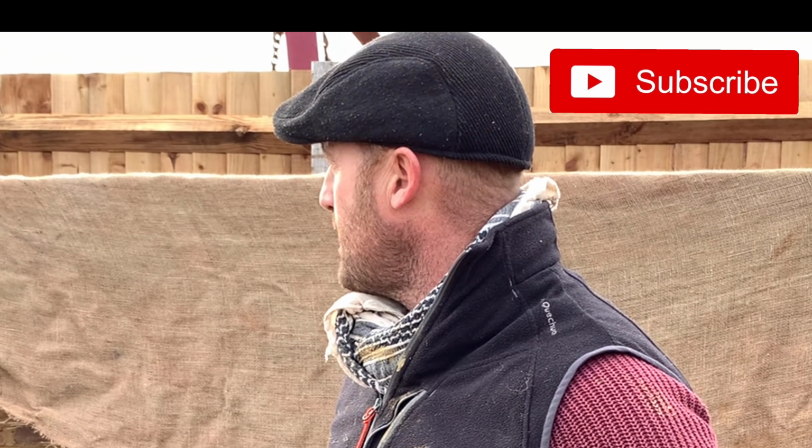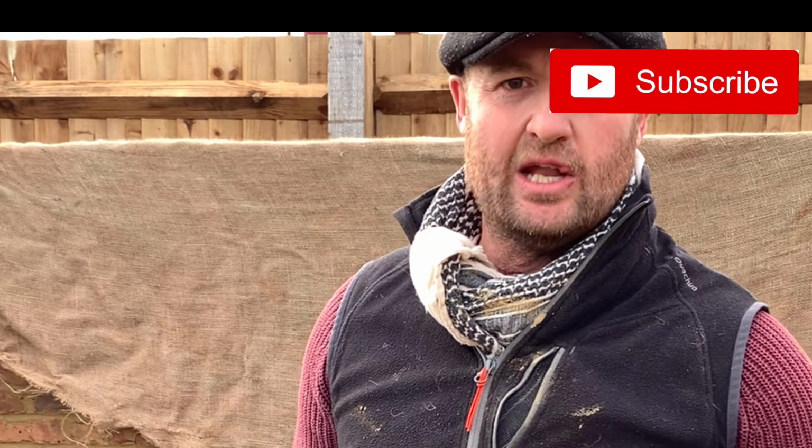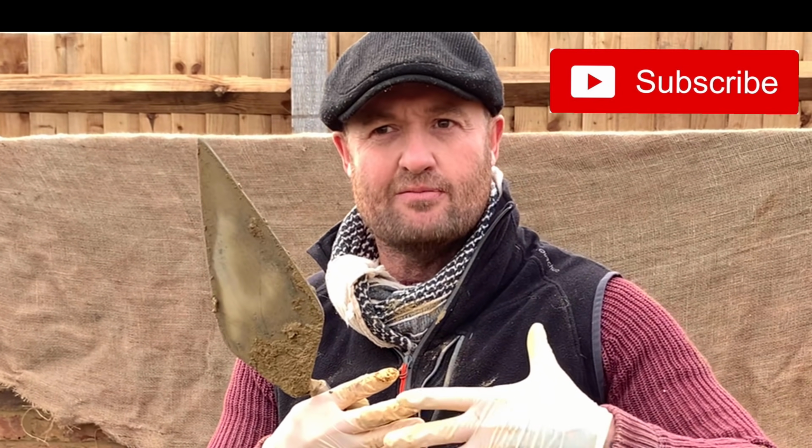So, yeah. What I'll do now is I'll meet the client down here probably Tuesday or Wednesday, and we'll go over it. Now, I've done a simple test panel here. I didn't do English bond. I didn't put in any feature. We've done stretcher bond because it matches the outside. Could I have done it in lime? Maybe give it a little bit of a feature. In my experience, when you're using the red stock, the white lime sort of is really loud coming at you. Almost looks like it's false brickwork, you know.